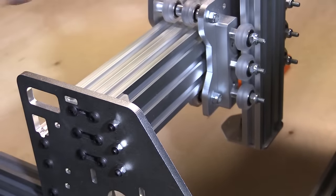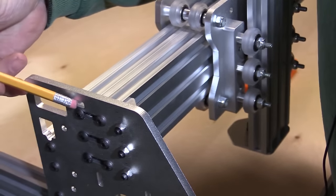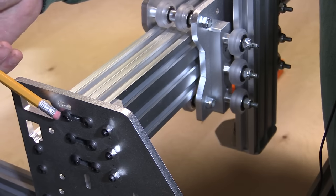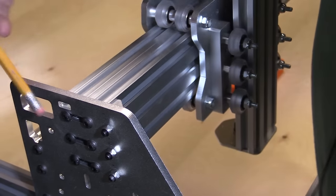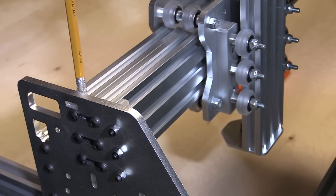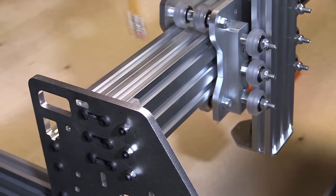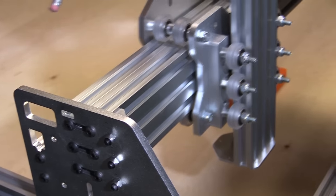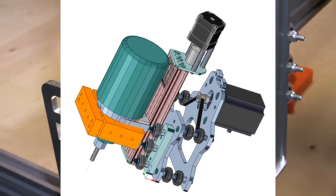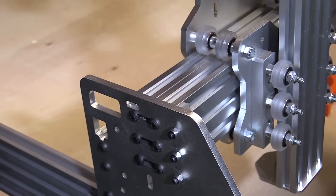On the top here at the very end — this back rail here — there's a hole that comes through the end. This will allow for the GT3 belt, and what's going to happen is you need to clamp that down so that it holds tight. I'm going to bring it through the hole here and use one of these bolts to clamp it down and give it some tension. The belt will then come along here and when it gets to the pulley, it's going to go under the first one, up over the gear of the motor, back down under this one, and all the way to the other side — keeping the GT3 belt flat to the V-rail the whole time.